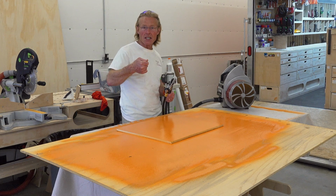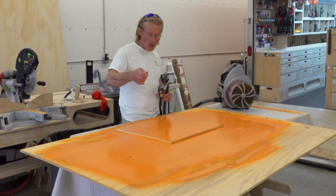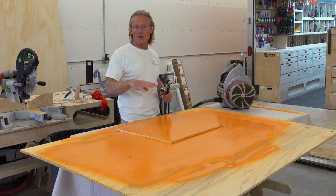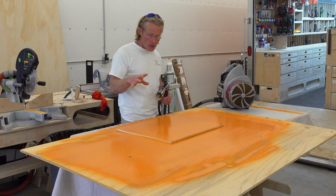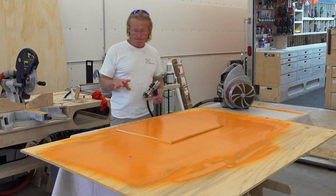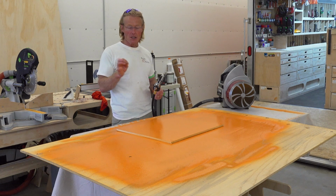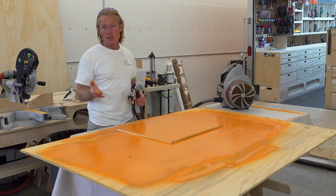According to the viscosity cup, even with the full amount of Floetrol in it, which has nothing to do with the machine, just measuring it with the cup, if I had the right specifications of 30 to 35 seconds, I was still getting well over a minute, even with the 8 ounces per quart. So maybe mixing in more. Also, the other thing I didn't do was possibly trying the bigger tip, because I went with the 4, went in the middle, and also going with the small one and try it.